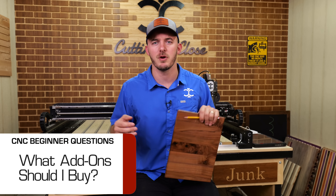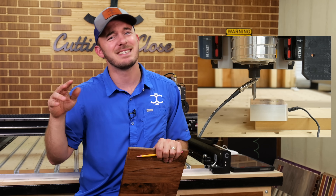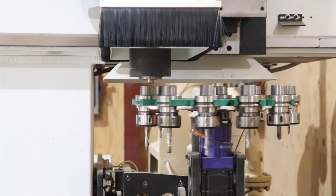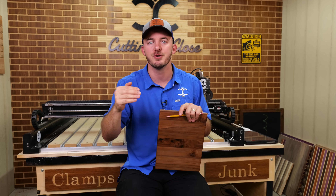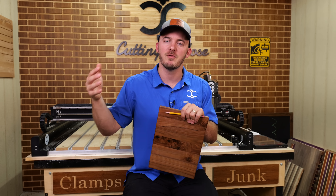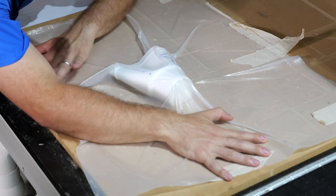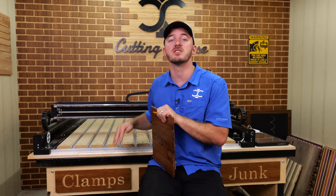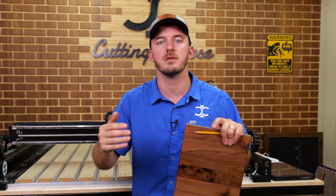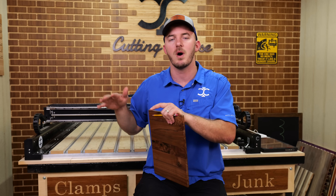What add-ons and accessories are the most bang for your buck? A bit setter is really nice to have. A touch probe is good if you plan on using it. Fourth axis — it's quite expensive and you probably won't use it as much as you think. An automatic tool changer is super nice but very pricey, and not utilized as much unless you're doing big production runs with multiple bit changes. Laser modules are nice but you can always add one after. Don't get it when first buying. For a hobby CNC, a T-slot table works just fine — you don't need a vacuum table unless you're running a lot of sheet goods.